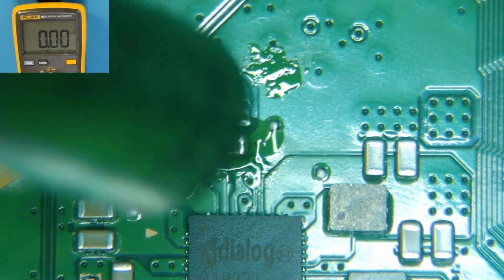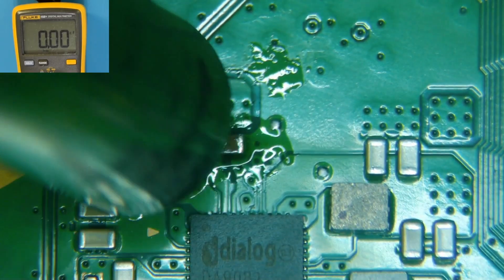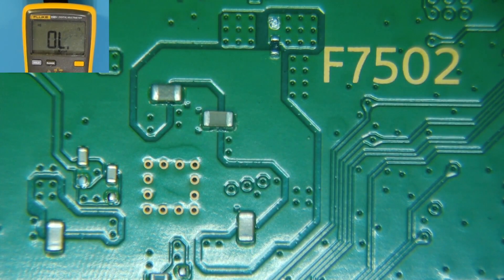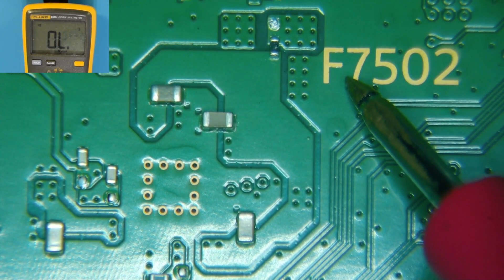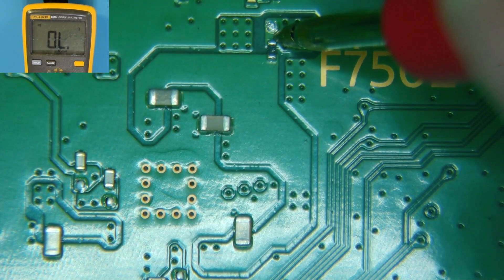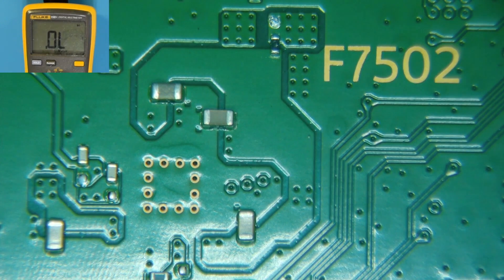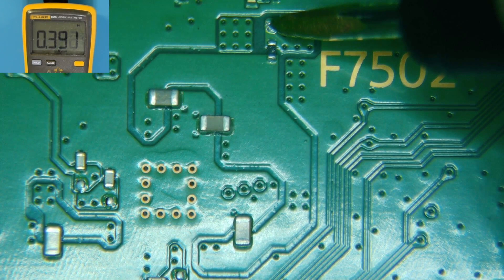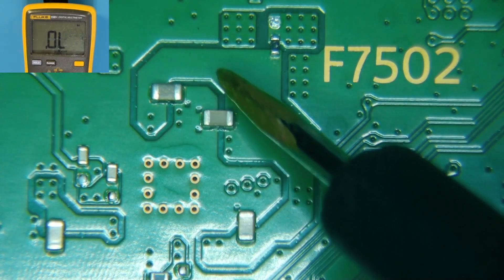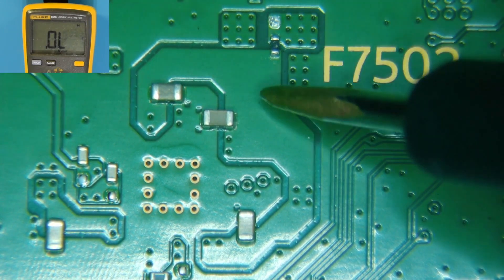It's going to be hard to get enough heat on the board like that, so I'm going back to the tweezers. I'm going to pull this board and look at the other side. On the flip side, we have that 5-volt rail that goes to F7502. Checking here to ground — we do not have ground over here, so yes, that filter is blown. Let's check in diode mode — we should have about 0.39. Over here we are straight to ground, so with any luck it should be one of these three capacitors.